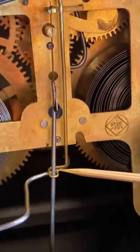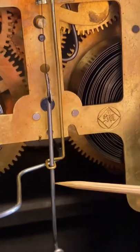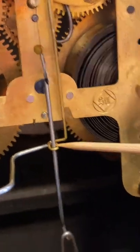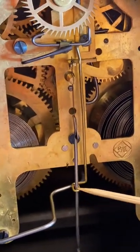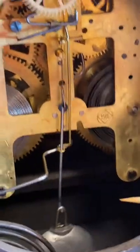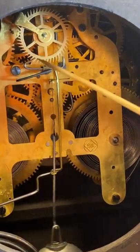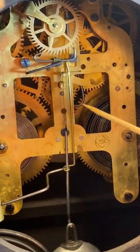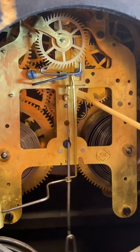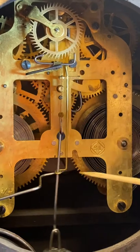Also make sure that the rod is in the middle of the hoop right here, because if it's pushing on one side or the other there's going to be friction that will stop the clock — this has to be absolutely free. This will work on any kind of clock with this type of escapement — it'll work with a deadbeat or a recoil escapement. We'll cover the different kinds of escapements in other videos.